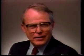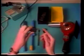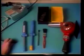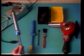By the way, I've had techs tell me that you don't have to worry about grounding unless you have carpeted floors. That's just not true. It doesn't matter what you have on the floors. If you're not grounded, you can't be sure you're ESD safe. The tools used at the bench, like soldering irons, have to be grounded, and devices like solder suckers must be made of conductive plastic.